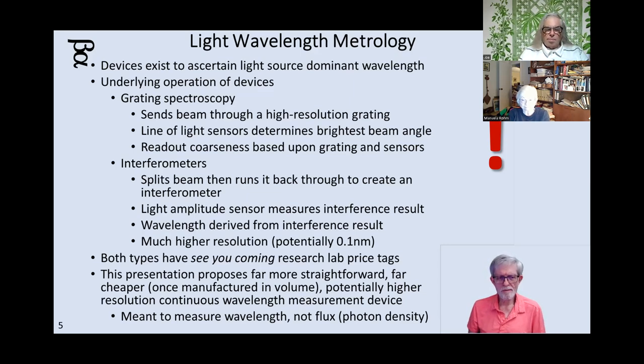If you go to buy a research-grade instrument for spectroscopy, it's a 'see you coming' kind of lab-results price tag. But if you go buy yourself a piece of grating material — which you can buy on Amazon for under ten dollars — and a HD-grade color camera for twenty dollars that plugs into USB, you can see the rainbow and pick apart the colors for easily under fifty dollars, giving yourself a spectroscopic camera. For the high-resolution calibrated lab thing, you go to Thorlabs and spend two to four thousand dollars.